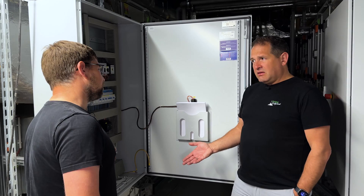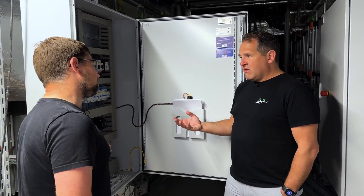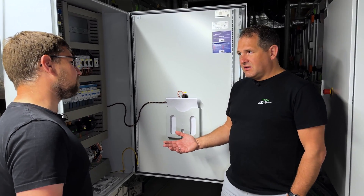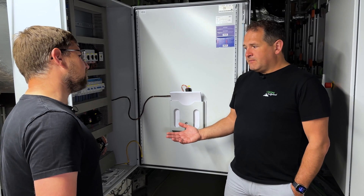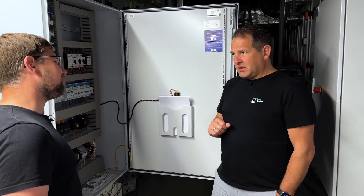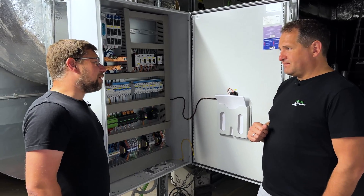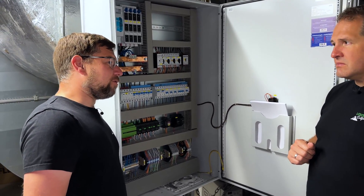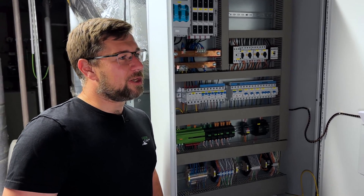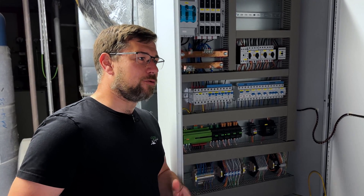The ventilation centers are not connected via a client gateway. Instead, each ventilation center is self-sufficient with information communicated via network intercommunication. All of the mini servers have a trust together. We currently have a simple system of user management — a user group which everyone involved in commissioning the campus is in. If we want to use a new mini server during commissioning, we simply add it to the trust and immediately every user can log in with their usual credentials to that mini server.